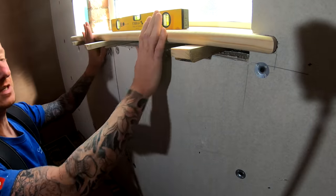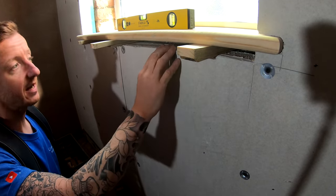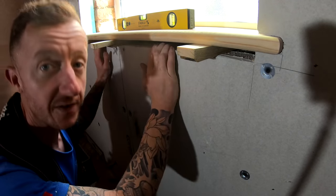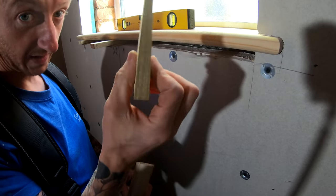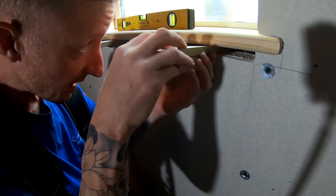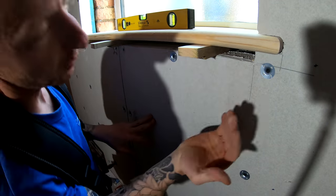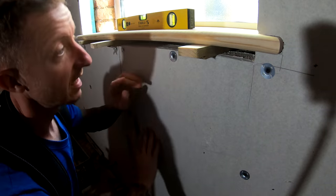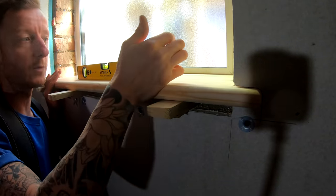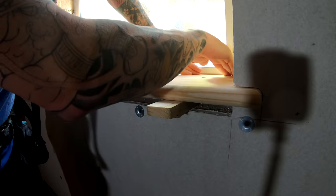We want to get this fixed in, but before we do there are a few things we need to get in place. Mainly the first one is wedges. You can see under here basically where the plasterboard is cut back — it was just cut to a nominal size and there will be some patchwork to do afterwards. We've got three sets of wedges for our three fixings — just a simple wooden wedge to bulk it up a bit because the wedges that were lined around were a little bit narrow. That will sit in there underneath where we're going to put our fixing through, keeping it nice and secure. You want to be directly underneath your fixing so it pulls it down nicely and keeps it exactly where you want it. Also, you may wonder why we did the little recess at the back of the sill — it's going to sit on the bottom sill of the window. So when you fix this down it puts everything nice and tight and holds it in place. You'll never see it under there — that's why we cut the recess out.